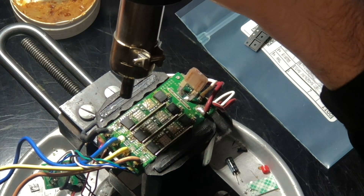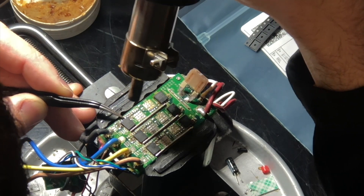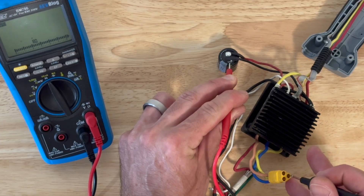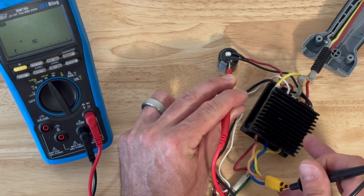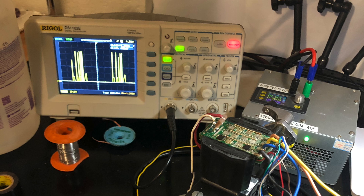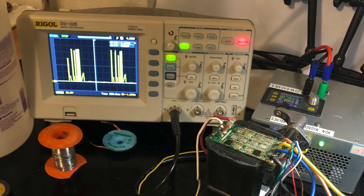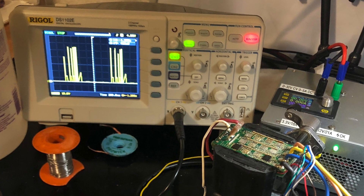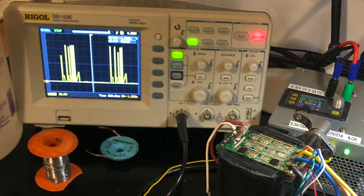I ordered a strip of them along with the proper fuse and waited. In the meantime, I desoldered the MOSFETs and tested them one by one. It wasn't hard to see the problem — on four of the six MOSFETs, all pins were shorted to all others. For a more refined testing method that doesn't require desoldering, see my Ego multi-head video linked in the description. I tried to get fancy and see what the other two MOSFETs were doing on the oscilloscope, but nothing much made sense. All I can figure is that the Ego controller is trying to start the brushless multi-phase motor, notices that two phases are missing or that the whole motor is missing, and shuts things down.